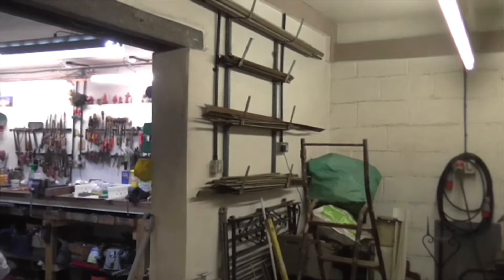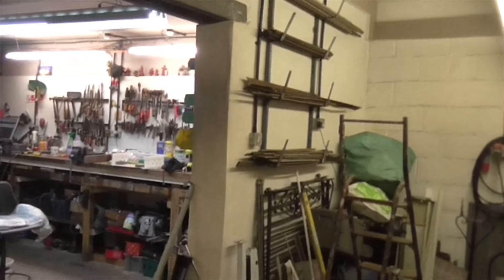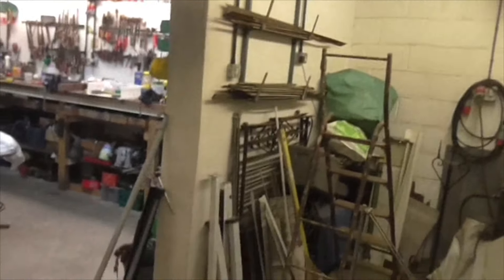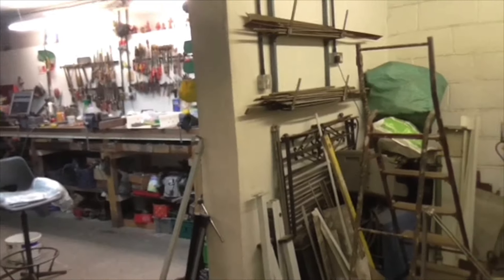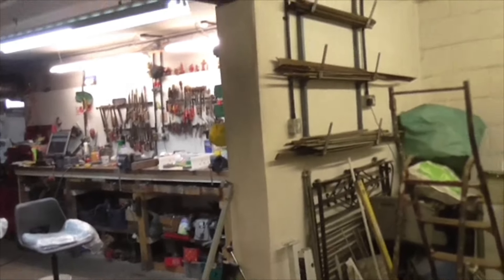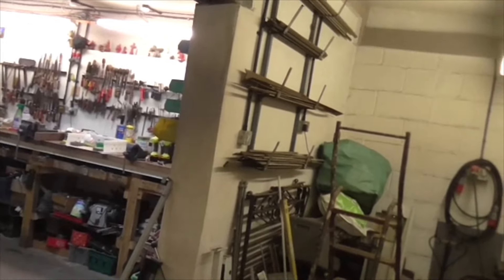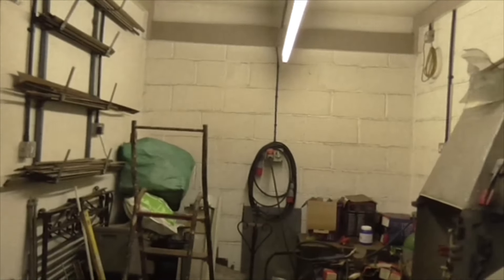Not fully loaded yet — I don't want to put much more on it because I'll be putting other racks in other places. It's normal to make these racks either free standing or going all the way to the floor so most of the weight goes on the floor and the screws just hold back to the wall. All the screws are in shear and it would take many tons to shear a screw like that.